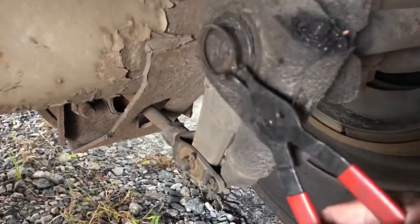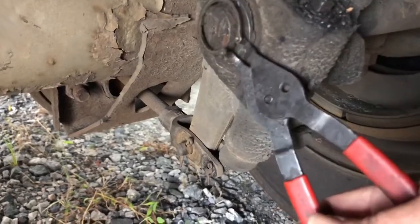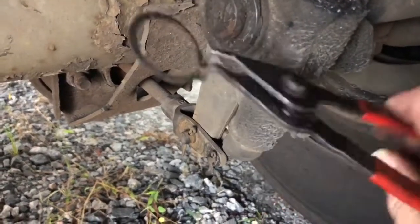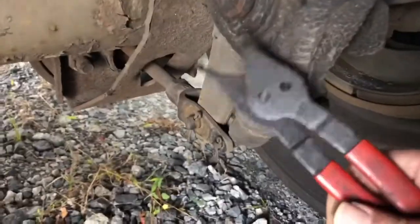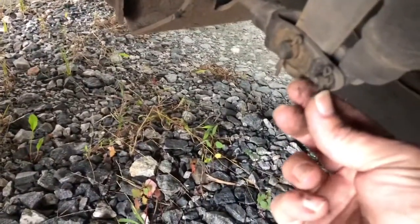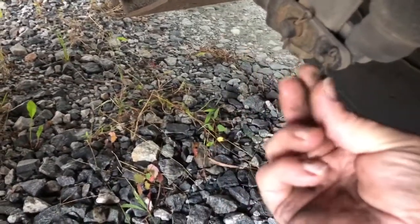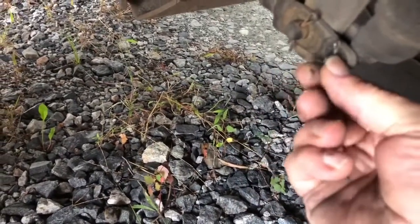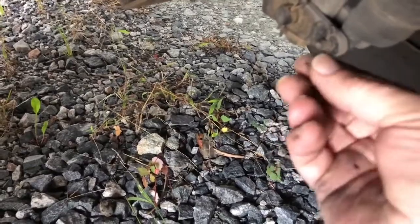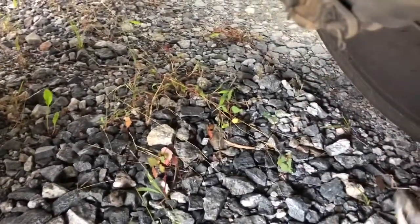Okay, first thing you want to do is take this off. I got the truck cranked up and air on back here. That's the first thing. Then you want to take this off. It goes right on there. It's a snap ring. Anyway, that's how it is. Then you want to get these out. And I've straightened them. And you just want to push them out of here and grab them with a vice grip, maybe tap them out with a hammer, whatever, get these out so that we can get the pins out. Lucky nothing's frozen up on it.